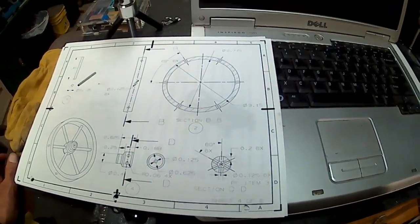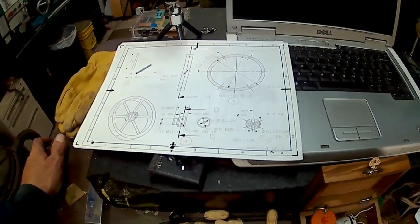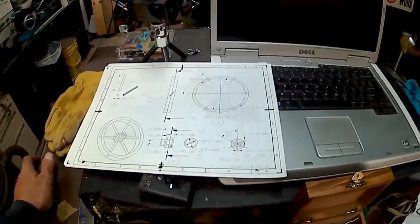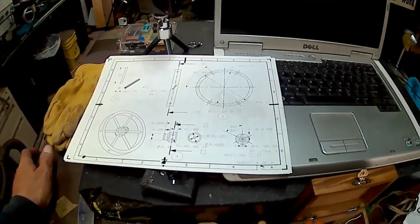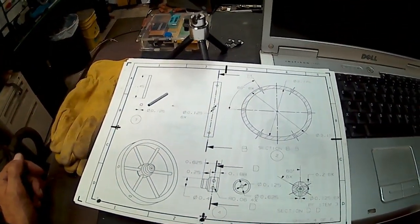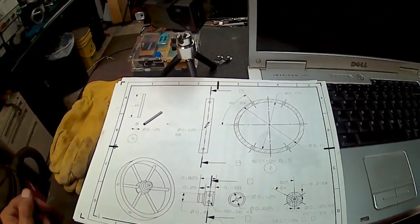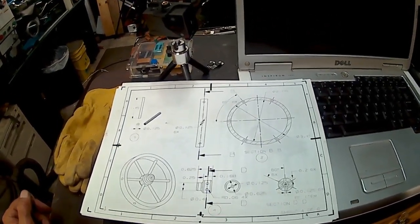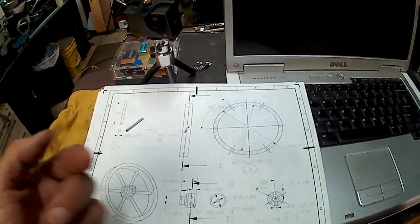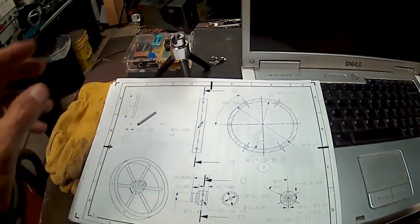So I need to round up some material, 3 inches, 150 in diameter. So then I can round up a piece of square stock, I suppose, and then go to the 4-jaw, bore the hole in it, and switch back to the 3-jaw, clamp on the inside, and turn the outside. Sound like a plan? Sounds like a plan to me. So I need some material, 3.5, well, let's go 3.25 inches wide, or width and height.